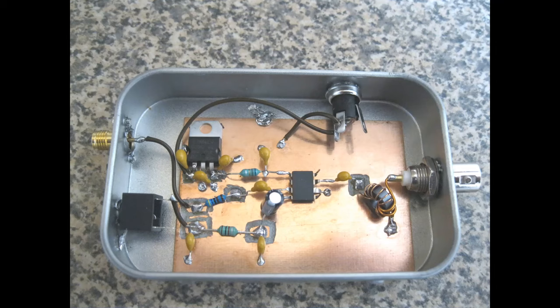Who knows? I bought a cheapy Chinese Dremel kind of thing, you know, one of these things for engraving and grinding and stuff. It's like a kind of pen attachment that you use. I saw some bloke on one of the homebrew Facebook pages who designed this, and I thought, what a good idea. Rather than getting the super glue and gluing my fingers together all the time and sticking all these pads down, I could just mark out the conductive pads, which are going to be electrically isolated from the ground plane. And then it has the advantage, of course, everything's on the same level.